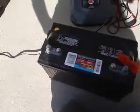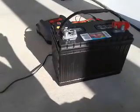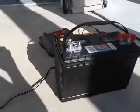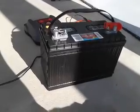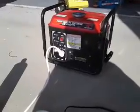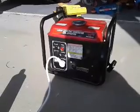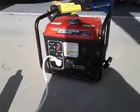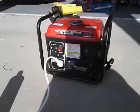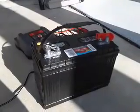So this 1,200-watt generator will keep your refrigerator going and some electronics going, and it'll keep this battery charged. Another reason why you want to use the battery charger and not run directly off the inverter is it's better on gas — this will only run as strongly as you need it to. So the generator can run at a lower speed while keeping the battery up, and you can turn the generator off sometimes and just run off the battery.